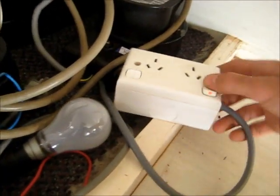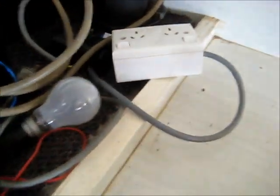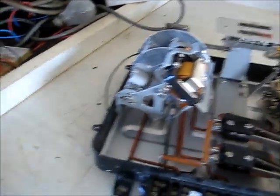I'm gonna put a plug top on the supply wire and put a double outlet GPO on the load wire — or a power point I should say. GPO is the proper industry standard name for it. I'm gonna have to make a little box because I don't have any of these junction boxes — that's the only one I've got.